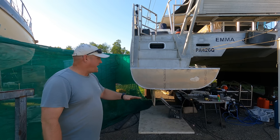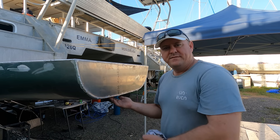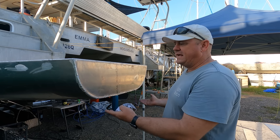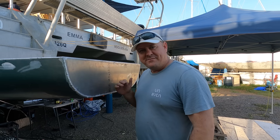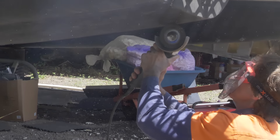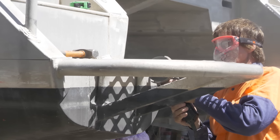What we've also done is we've taken the twist out of the hull, and if you look at the back here now we've got a nice big flat cross section. We did it so we could bring the sterns up shallower, but we also wanted it to be nice and flat so it doesn't slap — if it came up on an angle the side would slap. When we fair it up we will put a little flat edge on here, which will make a nice hard corner for the water to release from. The wake doesn't join until further back, as if you have a longer waterline, which will help with speed.